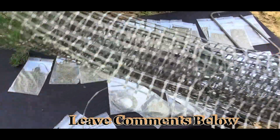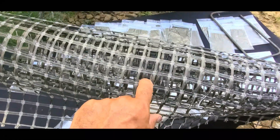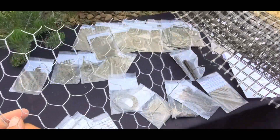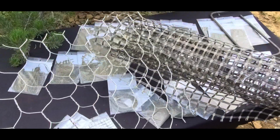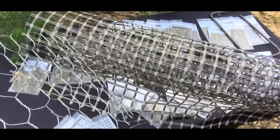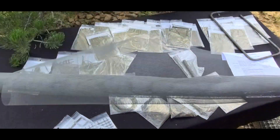For some structures I'm building using only basalt mesh, you can go more than one layer — spray it, apply another layer, and spray again. The only problem with that is cost. This stucco wire is about $80 and the basalt mesh roll is about $325, so price is a big factor in what you build with. But using multiple layers can massively increase the strength of your structure, even when it's still really thin.